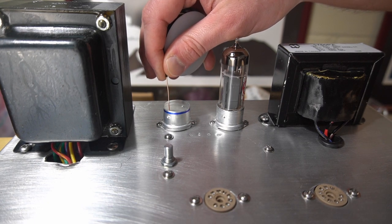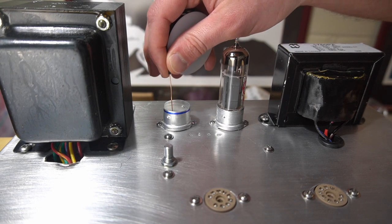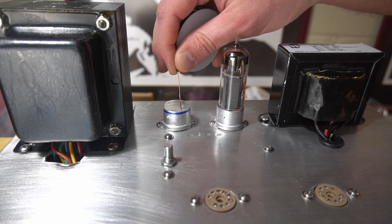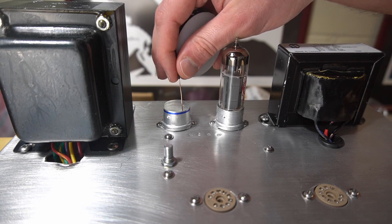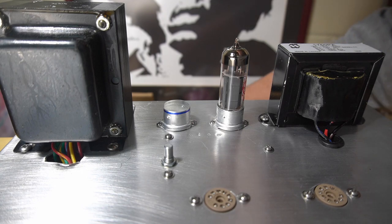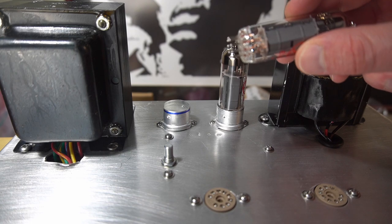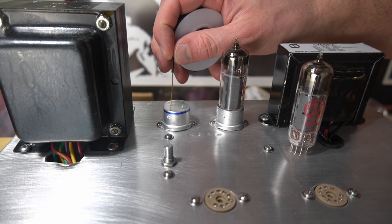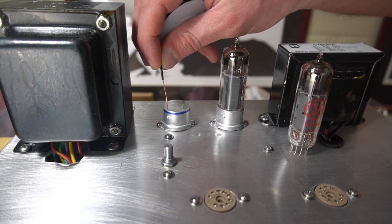1, 2, 3, 4, 5. I don't know if you can see that or not, but this pinhole, and then 6, 7, 8, 9. So with each of these I have a couple of millimeters of depth. So it's basically just the depth of the feet of these pins, right? It's just this much distance right here. I have the ability to put this little piece of wire down in, but in pin 5, it's all gummed up, and there is no depth.